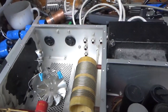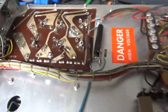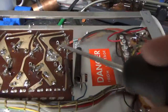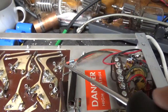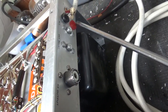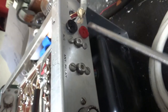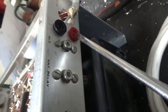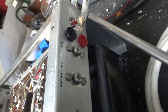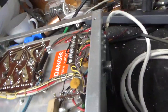I'm going to flip it over and show you the back. There's some really nasty solder work. This is the plate, this is the B-positive right here. He has a lead going from the B-positive over to this banana plug — some sort of pin plug going to a female jack over here. That is nuts. The gentleman said his father had set this up. I don't know if he was powering another amplifier off the plate of this amp or what. But that is scary. Please don't do that.